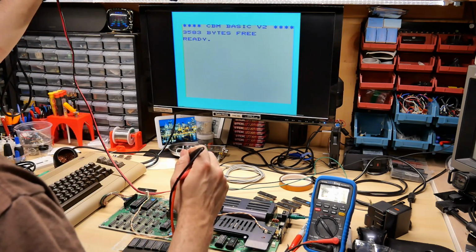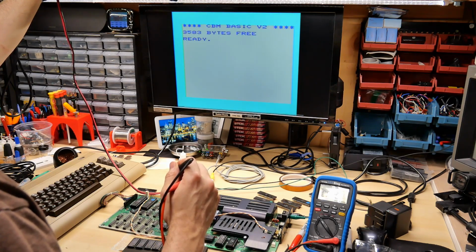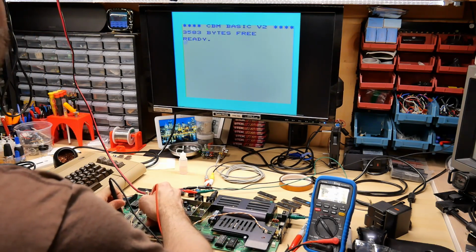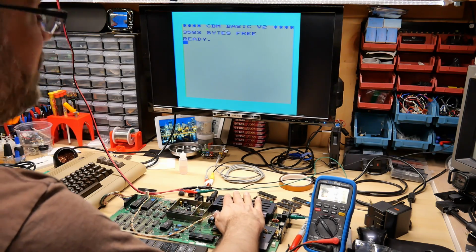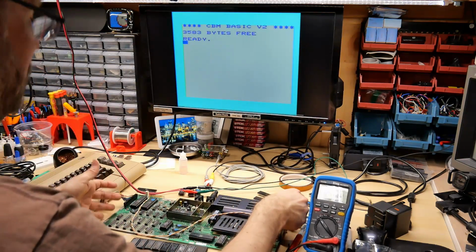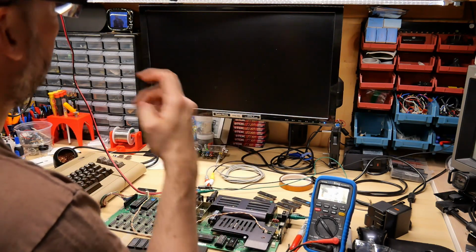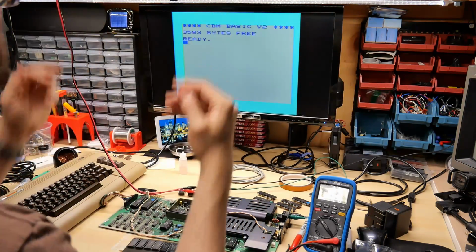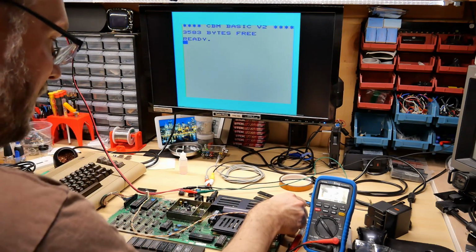It's a little bit higher, but ultimately it looks like you could run this down all the way to 10 volts and still be getting good voltage regulation. And I gotta say one thing about running it, yep, that's still good. Running it at 10 volts, it's pulling 1.33 amps, so this whole heatsink assembly will not get that hot. Now, it really looks to me like the color has changed a little bit, and this could be a side effect of the RetroTink. Well, let's turn this back on again. Yeah, maybe not. Maybe it's just my eyes. It looks fine. I'm not seeing the glitching anymore. So who knows? Okay, so definitely that one processor is bad.